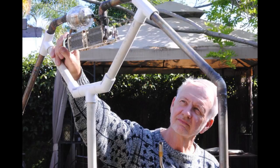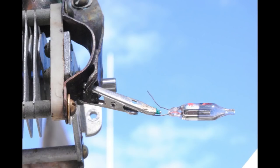Yes, that variable capacitor is always in there, and that's the one that'll tune from about 10 megahertz all the way to, I think, 28.7 or something like that. Without the top one. By the way, the top one's about 140 picofarads, and it's also rated, I think, 5,000 volts. Wow. So next time you're at a swap meet, be sure and find an extra one for Gordo and Jim.